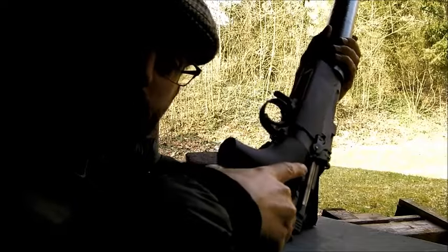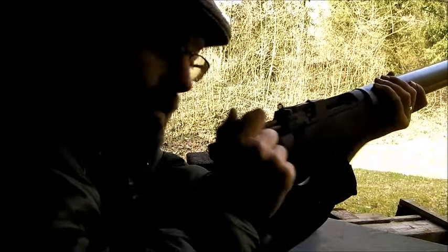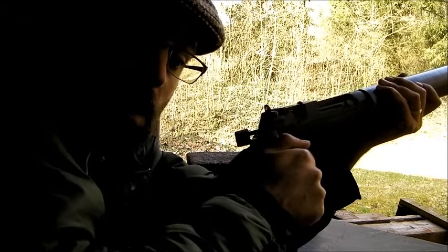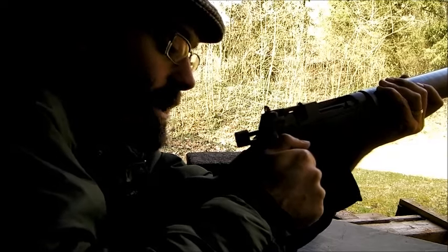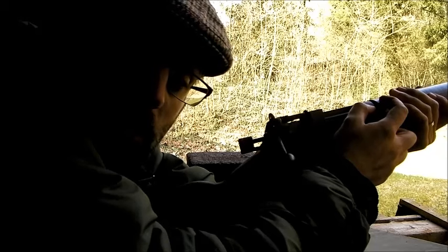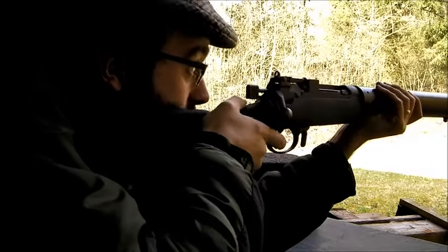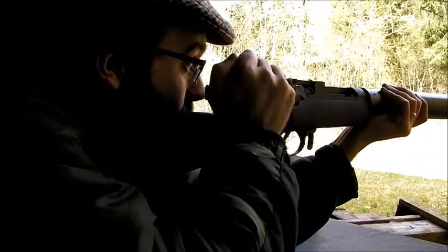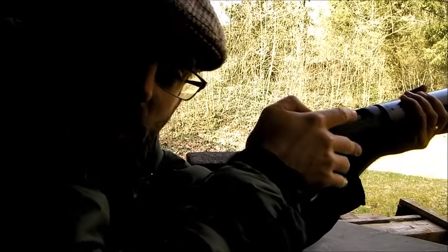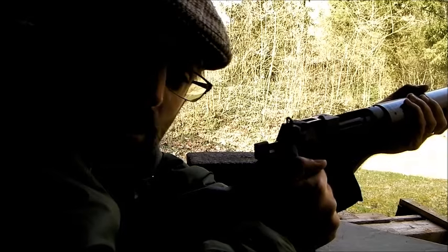It's a rear locker — the locking lugs are at the back. This means that the bolt throw isn't very long, because all it has to move is the length of the magazine. In a Mauser, Springfield, or Mosin-Nagant, it has to go further because of the space of the locking recesses. So the bolt throw on a Lee-Enfield is short. Also, the bolt rotation is only 60 degrees — this is something the French copied in the MAS 36, deliberately putting the bolt lugs at an angle.